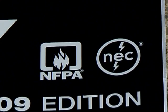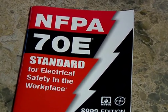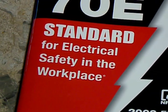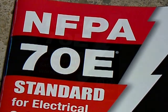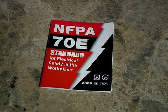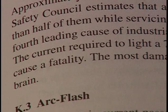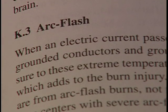The National Fire Protection Association publishes the National Electrical Codes, known as NFPA 70. The standard for electrical safety in the workplace is referred to as NFPA 70E, which directs us to beef up our protective measures when working on or near energized units. Although electrical shock has always been a common concern, these new protective measures cover protection from electrical arc flash as well.